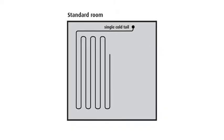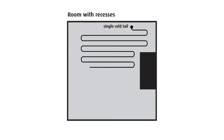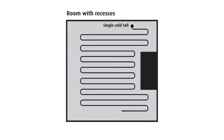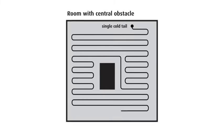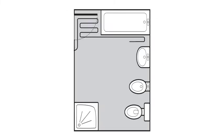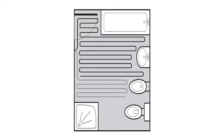The sizing chart provided is a useful guide to heater layout, but you may find it necessary to slightly alter the wire spacing to suit your room. If you are installing two or more heaters, refer to the guidelines in the installation manual. You need to make sure that all heaters start next to the Warm-up thermostat, and remember, however many heaters you are installing, the wire should never cross.